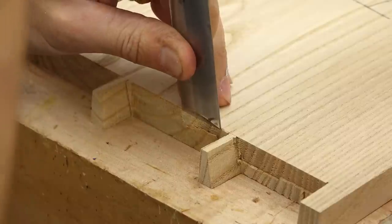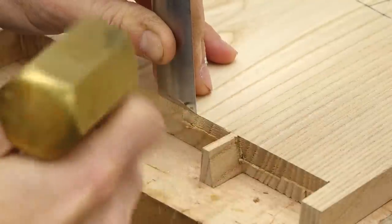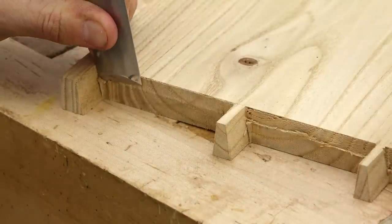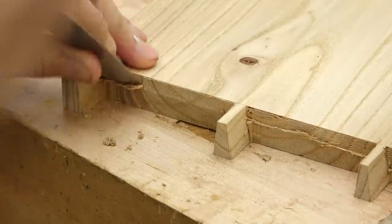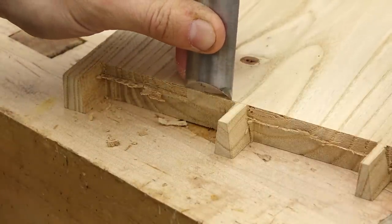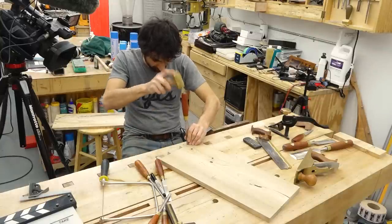It's not happy. It's like rolling up behind my chisel, pushing it forward. So I have to drift the chisel back into the cut. Yeah, see, it's bouncing. I'm bouncing out of the cut. So on this one, I'm intentionally angling the chisel based on what I learned over there from the beginning. And that's helping. That one actually dove and undercut quite a bit, which is fine.